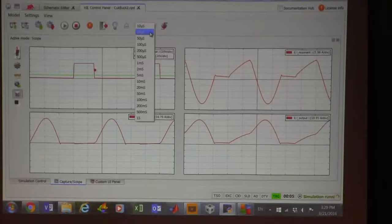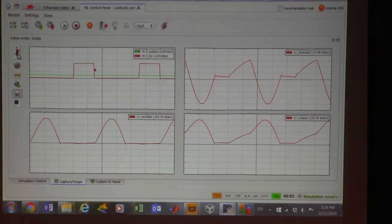Let's go back to the circuit itself. These guys draw both switches in a high-side configuration as one, so you don't need separate drive circuitry — it already has built-in dead time. You define a dead time and go back to the waveform. You see a trapezoidal shape — do you see that trapezoid? Can you enlarge that or show just one pulse?